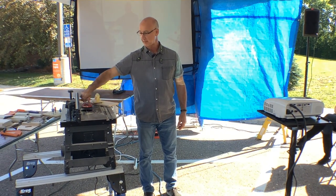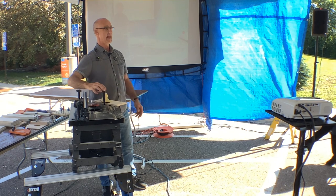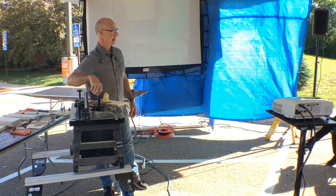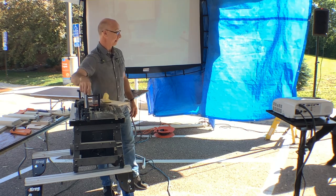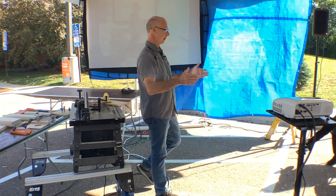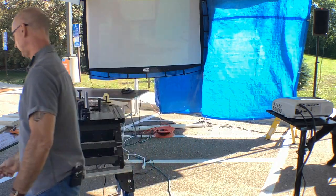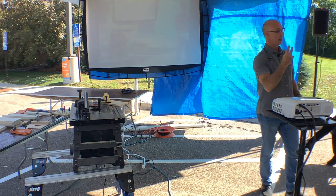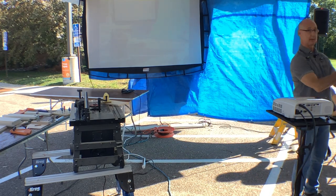So the way I approach that is, if you're using mechanical slides, they are fussy. A drawer box on mechanical slides should be 1 inch and 1/16 smaller than the opening you're putting it into. 1 inch accommodates the metal slides, 1/16 gives you a little bit of wiggle room so that you're not trying to force the drawer in. So the way I do that is I set up the rabbet cutter or the lock rabbet like we're about to do, cut it twice, good catch, put these two pieces together. So I have a rabbet and a rabbet.